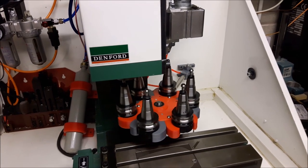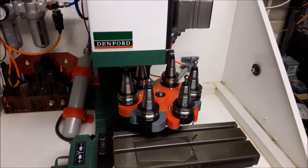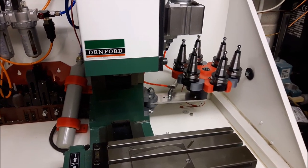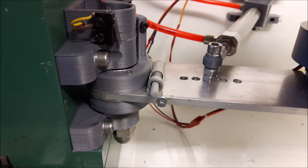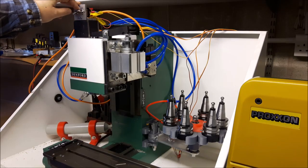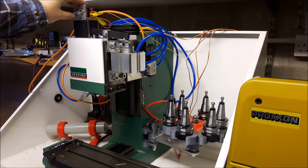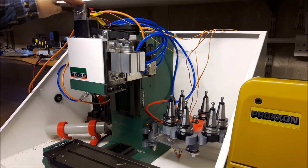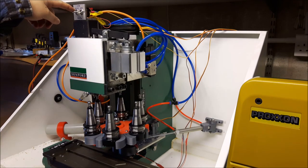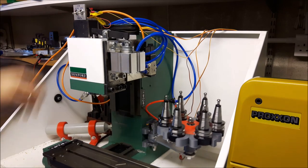So first test — it's all a bit violent. The speed's not too bad and that's governed by the air pressure. It's a double twin direction stroke, so it's powered in and out. What I did was add some of these dampers that you can buy for doors — I've got one on the extension side and one on the retraction side. And then if we look at how that makes it run, this is all a lot more civilized. You've got the actuation of the switches on the top there that run it, so I can go up for manual and down for auto.